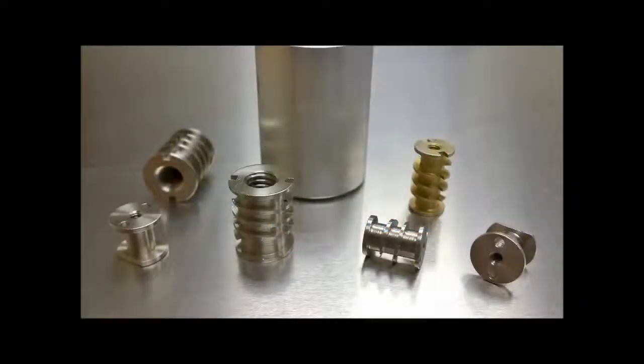Flat Iron Panel Products uses potted inserts to provide fastening points within aluminum honeycomb and composite paneling. After a hole is drilled in a panel, a cavity is created by routing the core back from the hole. The insert is then placed in the panel and an adhesive is injected to fill the cavity and form a secure bond.